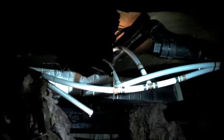It was emptying out the hot water heater. So as you can see here, this has already happened once before on a cold water line, and we had to fix it with brass and PEX piping, since the polybutylene is no longer available because the fittings are subject to a class action lawsuit and they're no longer manufactured.